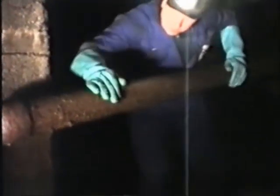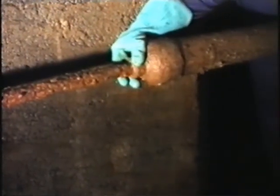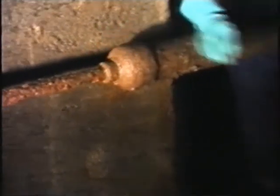Right. This is the compressed air pipeline coming out of the bell itself. As you can see here, it's a 4-inch pipe, but reduced here to an inch pipe, which would control the flow of air to the rock drills. At the bottom here, we have the large diameter pipe, about 15 inch diameter, that brought the water down into the bottom of the receiving bell.